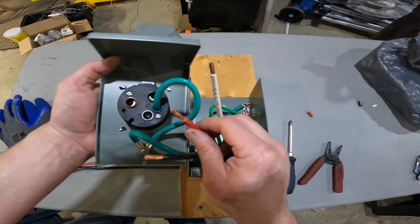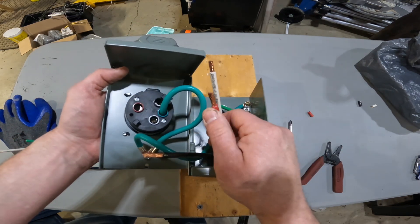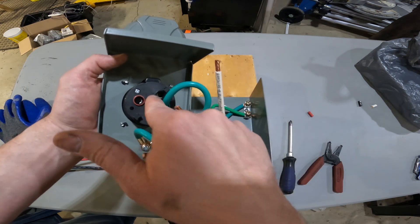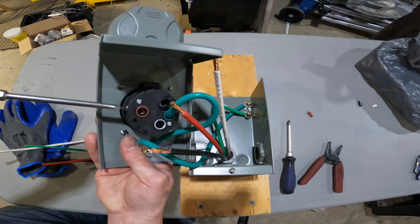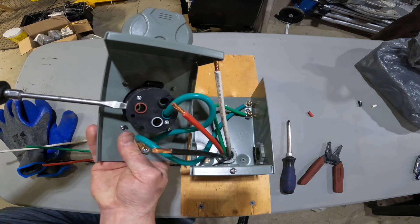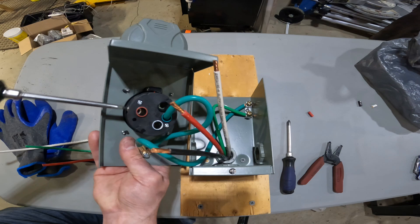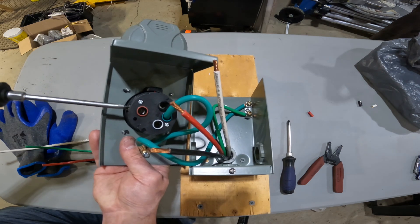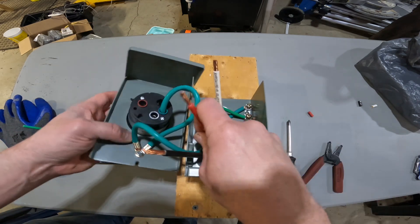The rest of this is really easy — it's almost foolproof. You've got red wire to the red circle, white wire to the white circle, and black to black. When these come, the terminal clamps will be fully closed, and you'll want to turn those counterclockwise to open them up. Now you can land your wires — these are stripped to about a half inch.